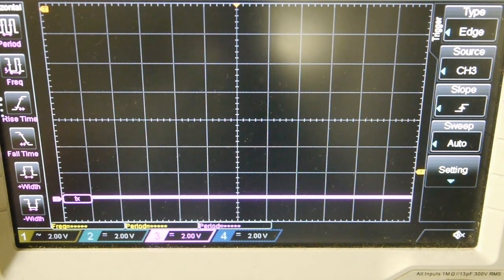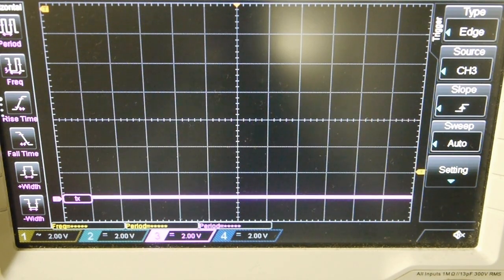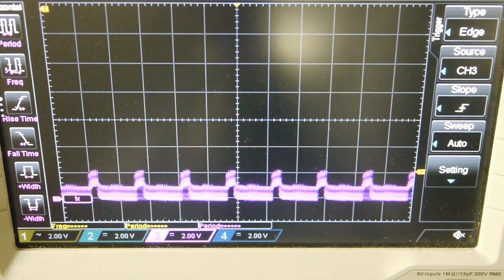I'm going to take it out and plug it in the other side. So let's carefully plug it in, because there's no case top, it's definitely trickier. There we go. So this is the other side, and we've got clock 1, ISA, sync, data, FI, PWO, B+, the missing battery, and then high on B4 and high on B3. Now clock 2 I left out because clock 2 looks like that, and I think that is actually the signal on the flexi, so I think there's something not quite right with this flexi in here. Because clock 1 is fine, clock 2 is like that, and it's the same on both slots on this side, so I don't think that's anything to do with my connectors.